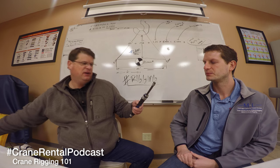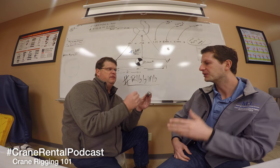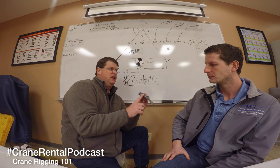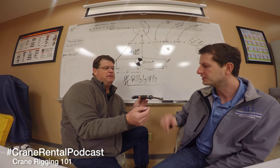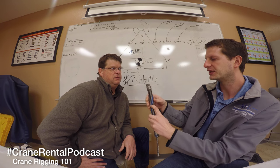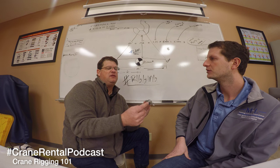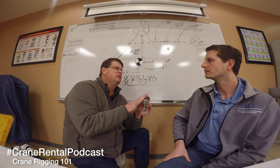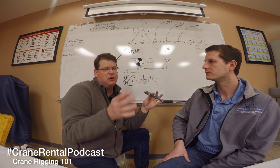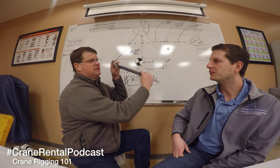My boss had a blown-up breakaway model made - it's really nice. It shows you the core, the strands, and then you can see the little wires that make up the strands. If you're watching this, we have a blue wire rope that goes all the way around - that's considered one lay. So the blue marks a strand, and each little wire is braided to make up the strands. This rope is called regular right lay, which is what you use to make rigging slings.